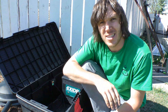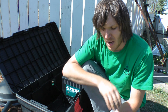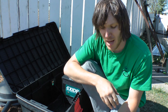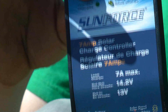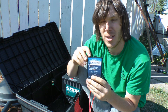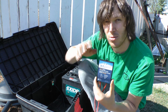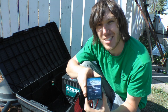Now that the batteries are connected in series at 12 volts, I can connect the solar panels. I don't want to connect directly to the batteries because you risk overcharging them. To prevent that, you use a charge controller — it shuts off the panels when the batteries are full. You can also get ones that prevent the batteries from discharging too much, which protects them from draining too low and getting wrecked, which I think was my problem last year.